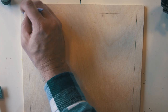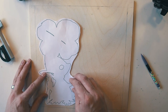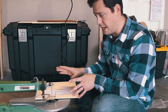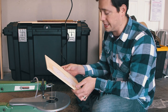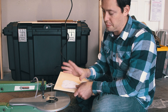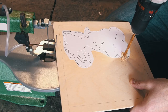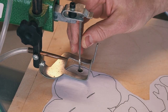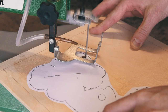I traced the border onto my half-inch plywood and positioned my Picori where I wanted it. Now there are different kinds of scroll saws for different work, and some are really good for fine detailed work like this — this one is not, but it's what I have so I'm going to use it anyway. I drilled a hole into the plywood, loosened up my blade, put it through the hole I just drilled, and then set and tightened it back up to start cutting the shape out.